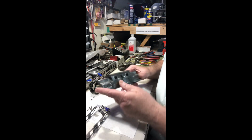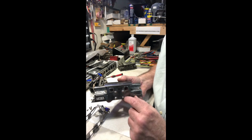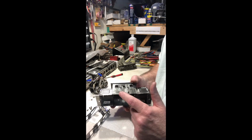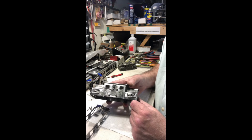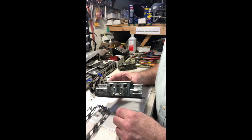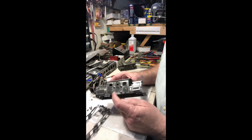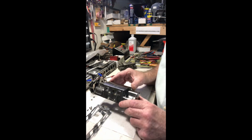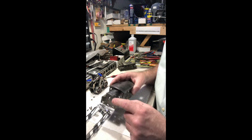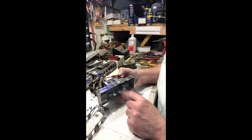And if you noticed on these, all the little railings where they attach, these stanchions are the type that solder on. Back in those days, that's what Lionel did before they came out with the handrail you may be more used to, that have little tabs on them. They fit through the hole, and you bend the tabs over from the back. These are independently soldered on at the factory, unless you lose one or break one, then you have to resolder it on. And they have them at each contact point where the railing hits. So they're brass. I like that.